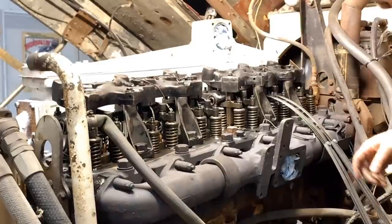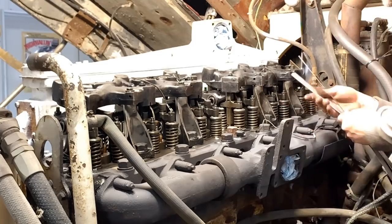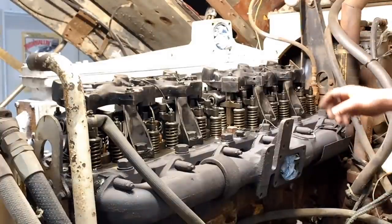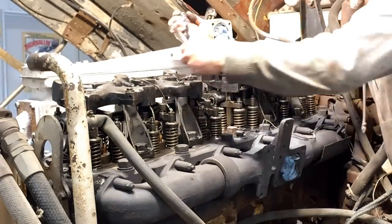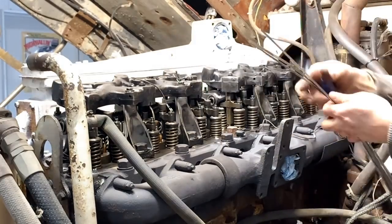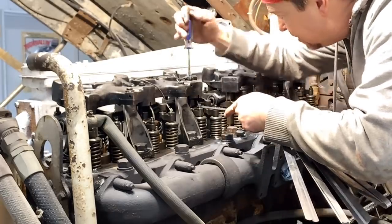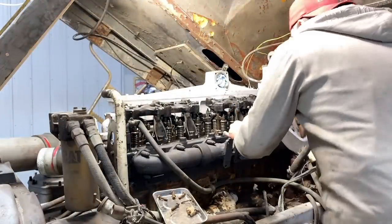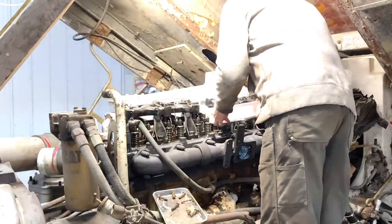I'm learning how to do this — I haven't set the jakes on LBL yet but now I know how to do it having practiced on the Duke. I'll do the same thing for two, four, and six. I won't bore you with spinning the engine all the way around since we've done that multiple times in previous episodes — just refer back to that if you're curious. The jakes are on and the jakes are set, so now we're just going to put the risers back on.